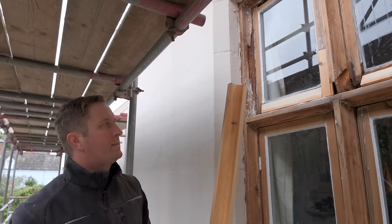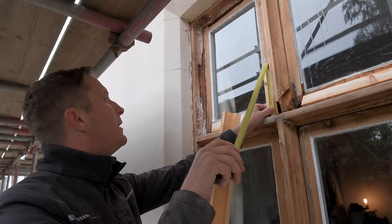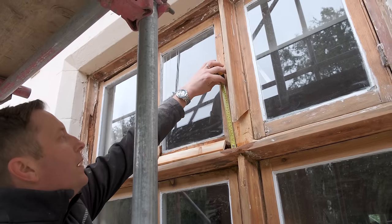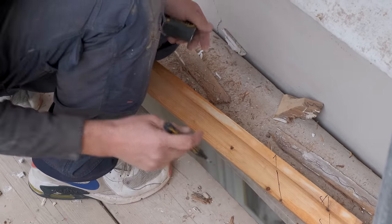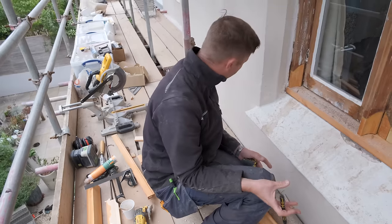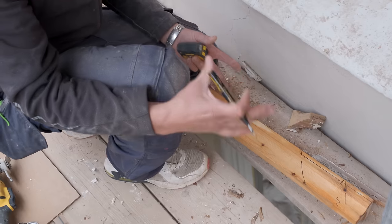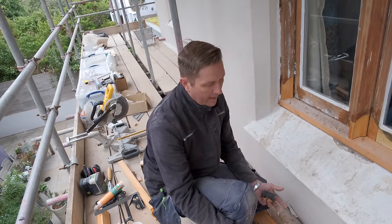All I normally do is just cut these roughly to length, scribing the bottoms as I see fit. So that one's to be approximately 90mm long. I'll mark which way I want it, and that will get cut again square. This is too big a piece to just offer up like I did the others — just small bits of kindling really. I don't want to be wielding about a big piece of timber like this. The next thing we've got to do is adjust the depth on it, so that will probably be coming off somewhere about there. And I will do this while it is in this bigger state, because it means I can feed it through the table and keep my hands well out of the way — it's the correct and safe way to do it.